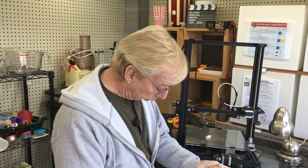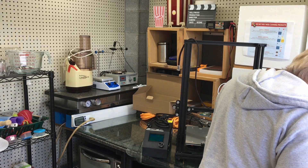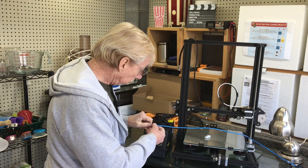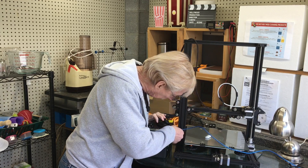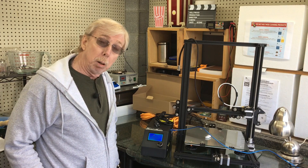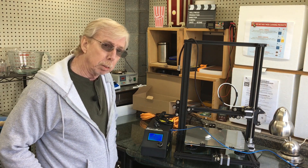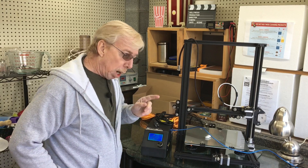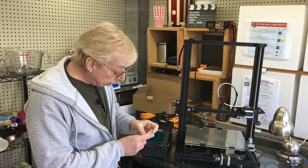Computer in reach. The slicer program I chose to use was Cura — I tried MatterControl and then Cura, and I liked Cura better. Even though it's not plugged in, it's booting up, scavenging power from the laptop. That's curious — that connectivity would be there, but yet Cura says it doesn't see the printer. So there's something wrong, perhaps on the motherboard. I was down but not out, so I went to the TF card, and thankfully the TF card worked just fine.